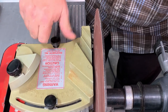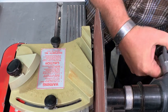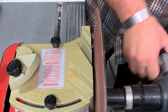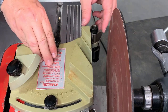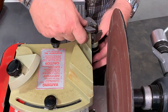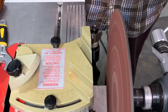It's just the cutting edge that we're concerned about. That's the position where I'd want to lock that — I'm just wanting to kiss that surface. So I'm going to lock the quill out here for a moment and set that as our zero depth on the depth gauge. Now I'm going to back this off. Might as well move the handle over to this side to make my life a little easier. I need to tighten that nut. It's a crazy hot day in North Carolina. Hopefully we're not going to rip our sandpaper off — it can happen.